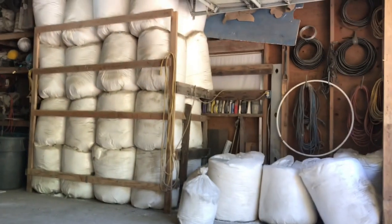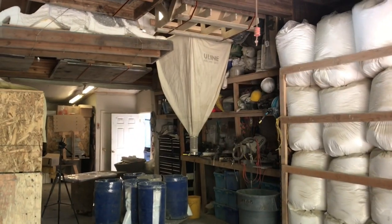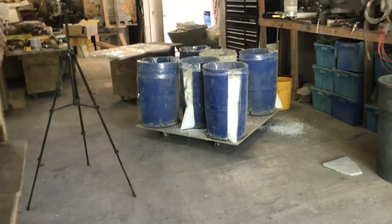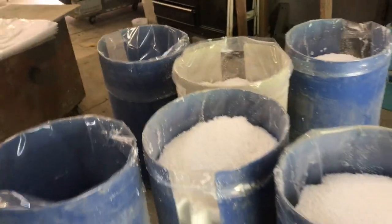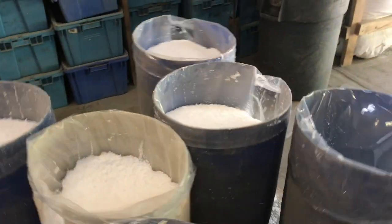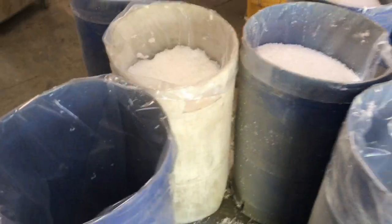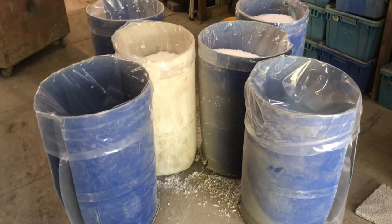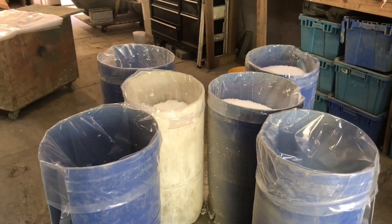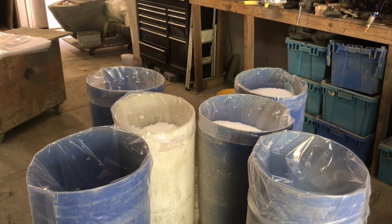If you need information on the formulations, get a hold of me — my contact info is in the description below. I've got a hopper up there that these bags fit into, and then I dispense it into a six-gun shooter. This bag holder I made rolls so we can move it from the foam-filling station to the cement area, then the lime area. We want this six-gun to be mobile so it can go around the shop to different dispensing stations. Then we zip-tie it with a rebar quick-tie and load it on the trailer for Tustin, California.